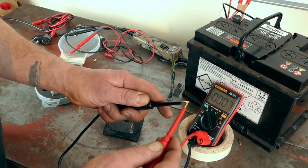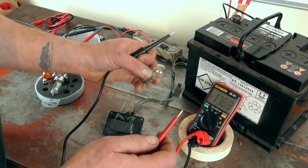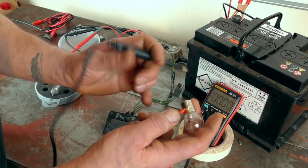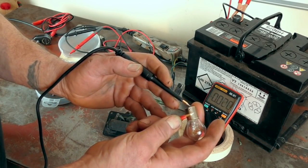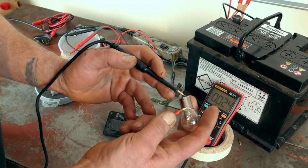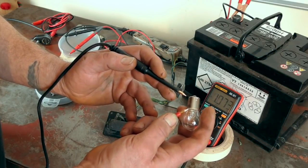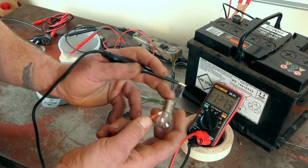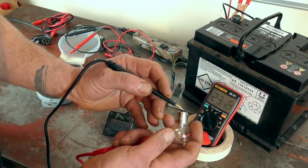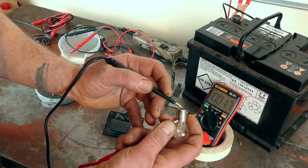We're happy that that's stable. With a light bulb — simple test — you have continuity and you can see it's stable. When you take the probe off you get ghost voltage. Or if something is insulating the circuit so it's not completed, you'll get ghost voltage again; complete the circuit and it goes solid.